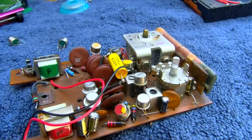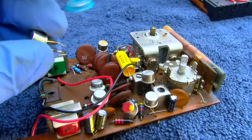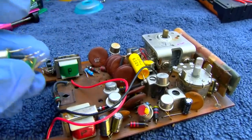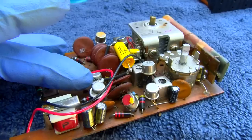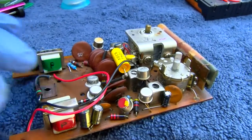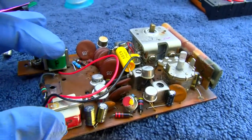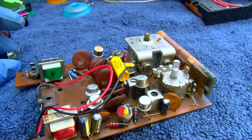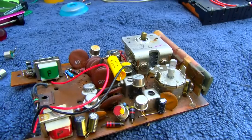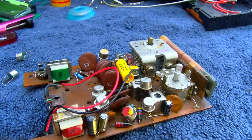And this uses a combination of NPN and PNP transistors. So I have to pretty much eat everything I said so far. Anyway, these two test good. The two MP40s, I need to pull those out and see if they're wired in right. These often do not just drop in the same lead pattern as these. So let me keep looking at it. We're going to get to the bottom of it. It's going to work, and I'm going to come up with a proper explanation here without assumption.